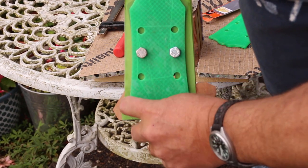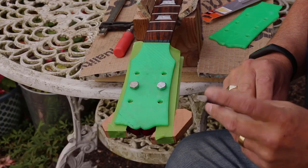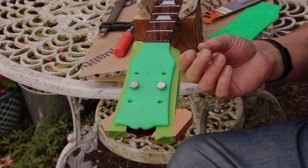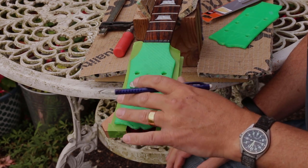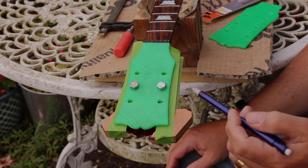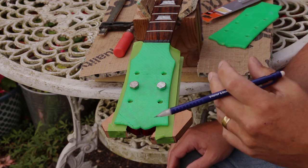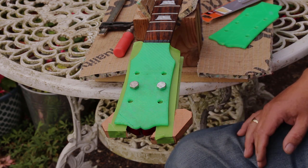You can see here it's pretty good and even here it's pretty good. When you're marking wood you want to use pencil — don't use pen — because the ink can be absorbed into the grain of the wood. You can sand it to size and finish it ready for spraying, and you can still have ink in the grain that can bleed into your final finish. The same with tiles if you're ever tiling — you don't mark the back of a tile with a felt tip because it can migrate through the porous china and then you can start getting marks coming through on the front of the tile. Just a little tip there: you use pencil.